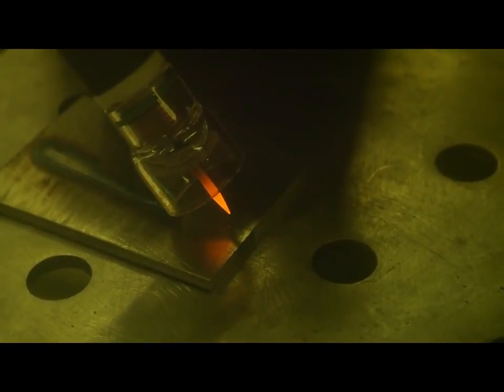What I'm doing is getting the puddle to match the diameter of the tungsten, and then I'm going to move across the plate and keep the puddle the same diameter all the way across. Now as you weld, the plate is going to heat up and you're going to have to taper off on the pedal a little bit. Make sure you keep the same size weld. When it's done, you should have a shiny weld bead run across.